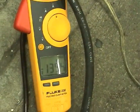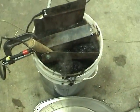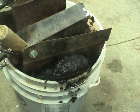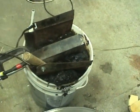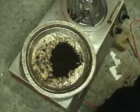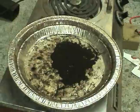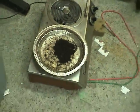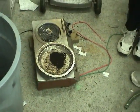We're running at 139 amps at about 17 volts. The water is quite hot right now, probably just about boiling — we're starting to get some bubbles coming over. This has been running for about three quarters of an hour. We have some rust down here we've made previously; it's just baking to convert it from iron hydroxide into iron oxide rust.